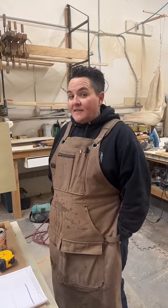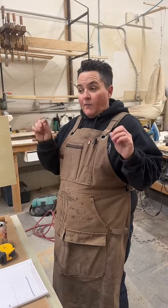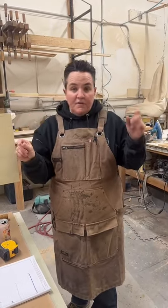Along those lines, townhome fixer-upper, how much spacing do you typically need when you're installing cabinets or measuring for that space? Who was that? That was townhome fixer-upper. Measuring exactly for what? Are you measuring wall-to-wall cabinetry? If so, I would leave... If your wall to wall is, let's say, 8 feet, I would minus an inch, so I have a half inch and a half inch of spacing